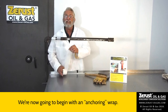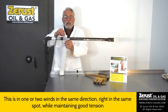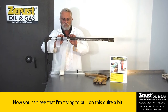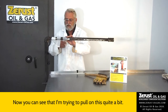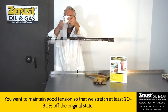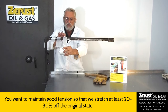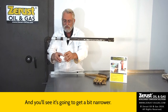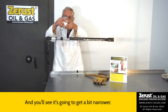We're now going to begin with an anchoring wrap — one or two winds in the same direction, right in the same spot, while maintaining good tension. You want to maintain good tension so that we stretch the tape at least 20 to 30% off its original state, and you'll see it gets a bit narrower.